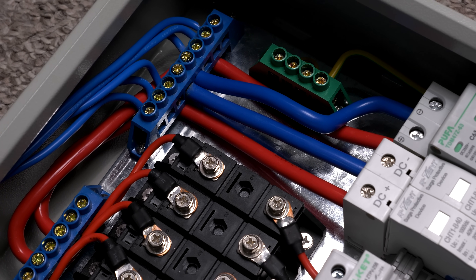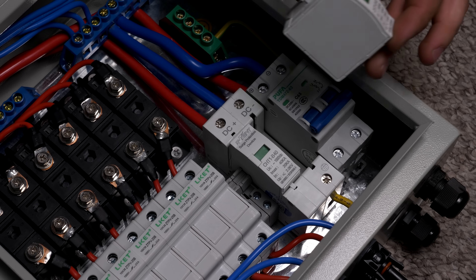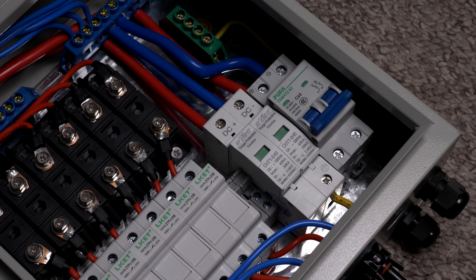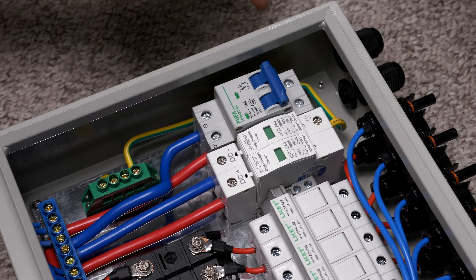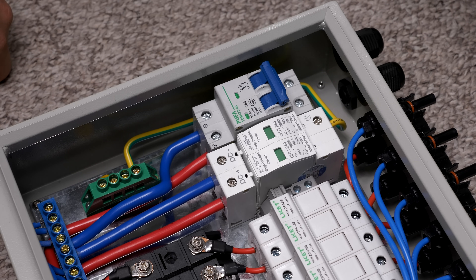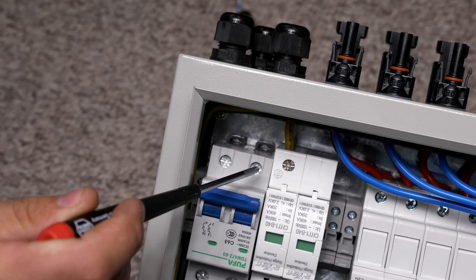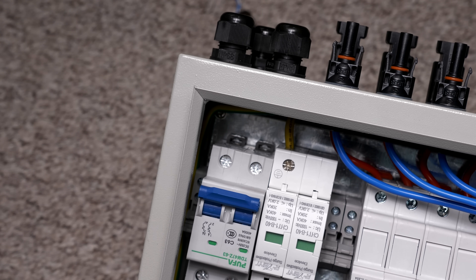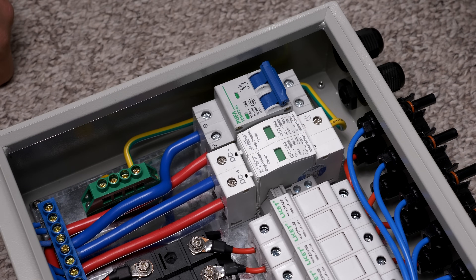You may just want to check your connections and make sure they're really tight. The two wires run into the surge protector — you can just grab them and wiggle and the modules come out. I don't believe these are resettable; if you trip them you'll need to replace them. Now, the main breaker: there really isn't much room in here to land the wires. If you're running a number 6 or number 4 wire for this 60-amp panel, you really need room to maneuver it onto that breaker. Also, the clips on the bottom of the din rail to remove the breaker become inaccessible once you've landed the wires — I'm not sure how they're intending for us to land wires in a safe and effective manner.